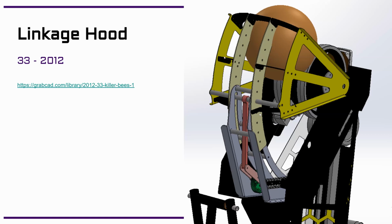It's relatively simple. There's some sheet metal side plates, right? You have some flanges that help add some rigidity to it. They did all sheet metal pieces going between this, except for here where they have the rod, which you probably wouldn't want to do again, right? These sheet metal pieces don't actually add that much rigidity, right? Because we discussed sheet metal, since there's no flanges on the sides here, these whole things can just kind of bend.